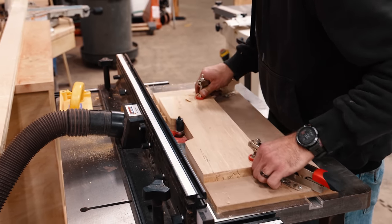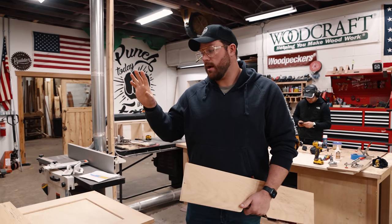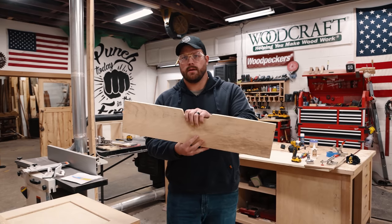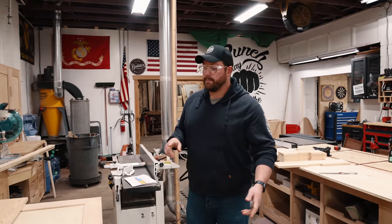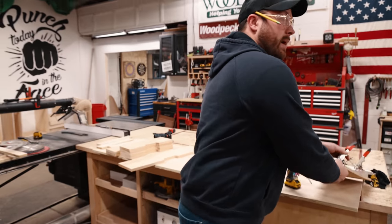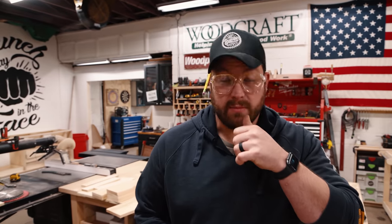Sam has been doing a good job of getting all our doors and drawer faces together. We like to do these integral handles — the reason I like these in the shop is you don't have something sticking out you can catch your pants on when you're walking by. And the drawer pulls don't cost me any money. We've got a flush trim bit from Bits and Bits, and a template from one we already had. We make so many of these that we actually have a jig we just clamp into and go. That's what you've been seeing Sam do, and that's what you'll see me do on this door.